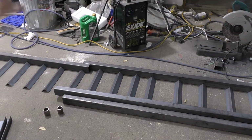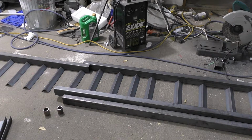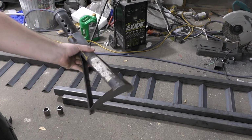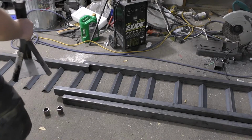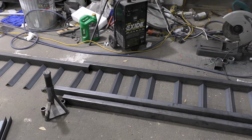And if you're wondering, these are the same 2-inch by 3-inch 120 wall tubes that I use for the bumper, and they will work for these ramps. Now, I won't be able to free span it, so the design calls for right about in the middle. We'll just put a jack stand, probably just take one of these cheap jack stands. It's a tripod style with a platform. Set that right in the middle, so that way it can carry the load, and we should be set up perfectly. So, I suppose let me go figure out the old calculations here, and we'll see what we end up with.